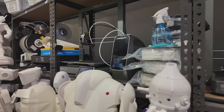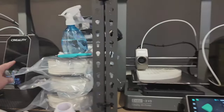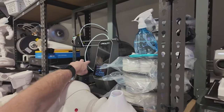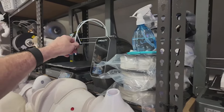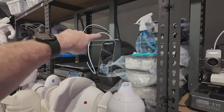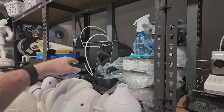What I'm going to do is show you this filament dryer over here with a Bowden tube that will go up into the filament runout sensor of the Plus, and from there I've got the Bowden tube leading into the head, so I'll load it up in there.